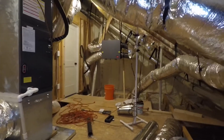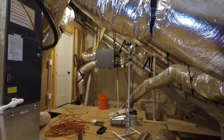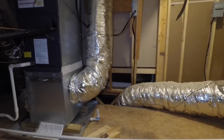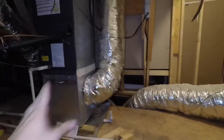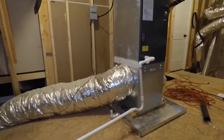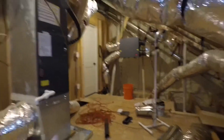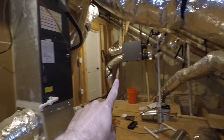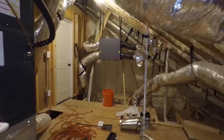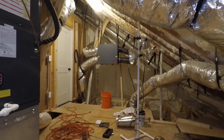The ERV installation cost me about $3,000. I could have saved a good bit of money by not buying all the ductwork for the ERV and just hooking it into these units. But eventually I would have eaten up that savings in a higher power bill because these two HVAC units would be running all the time. Now, if I had a one-story house with just one floor and one HVAC unit, that might be easier — just tie the ERV into that one unit. But the ERV alone was $1,100, and I did not want to buy two of them at $1,100 each running separately. With this one unit, I've got it ducted through both the main floor and the upstairs — it's a 150 CFM unit, which is plenty big for my house.